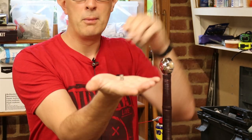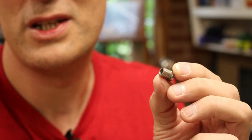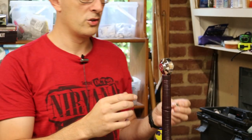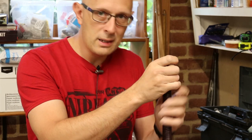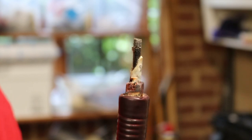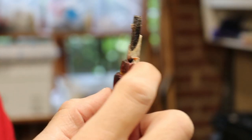It is a recessed nut that goes down inside the pommel, giving quite a long area of threaded contact to hold onto the pommel. Now, with the nut put somewhere safe, we take the pommel off with a little wiggle and it pops straight off. Let's have a look at the actual construction — that's what was under the pommel. I can't say it's particularly tidy. The white stuff you see here is glue — some sort of epoxy I imagine — and then the grip has been cut square to fit inside a recess in the pommel.